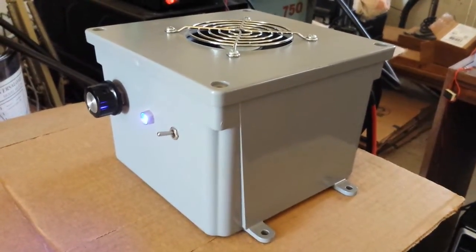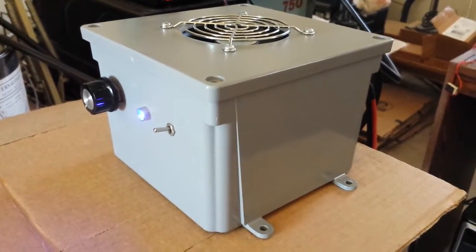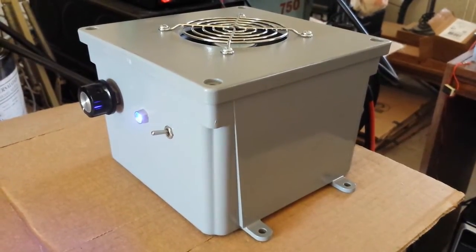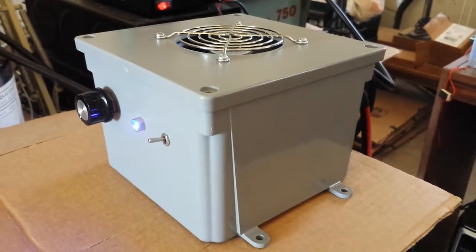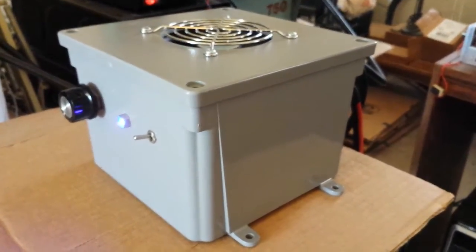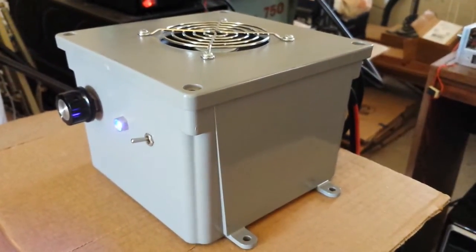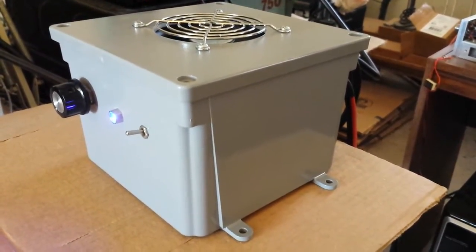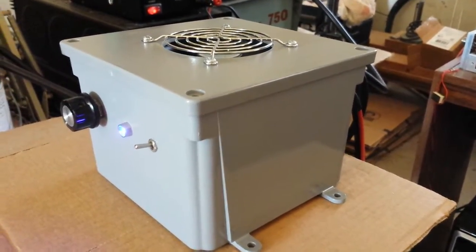You just don't see people doing them. I myself don't think I've ever seen an amp built in a plastic box. You build a amp and put it in a plastic box with the wrong kind of plastic, that thing gets hot and you're gonna melt through the bottom of it. But this right here is very high quality plastic — the heat sink is actually not touching the bottom of it. Even if this puppy did get hot, this plastic ain't melting. It's got a good airflow fan system on it.